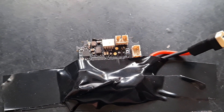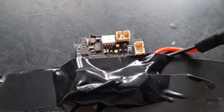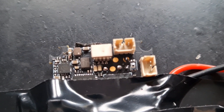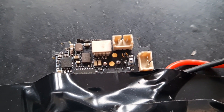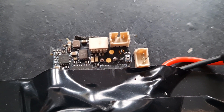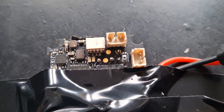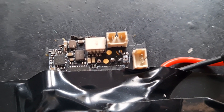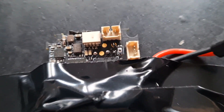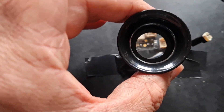The pads are tinned up. It's not the prettiest in the world — this is quite challenging because those pads are absolutely tiny, and they're all nestled in between different components and plastic bits. So if you're not quite conversant at soldering, do not attempt this. And certainly don't attempt it unless you absolutely have to install an external receiver, because this is proper fiddly. You can also check your work with a 5x or 10x loupe to check your solder joints.